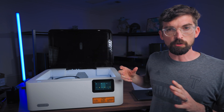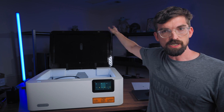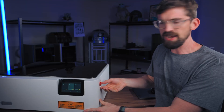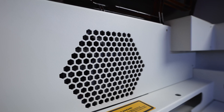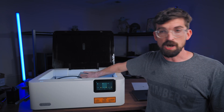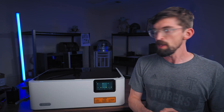Since this is a laser, it comes with required safety features. It's a Class 1 machine, meaning it's fully enclosed. It has sensors on the front — I believe just a magnet — to detect when the lid closes, and a little status indicator to show any errors. On the side there's an emergency stop button that cuts power completely. On the ventilation side, there's a fan on the back with a metal frame protecting the blades, which is a nice touch since those fans are often completely exposed.